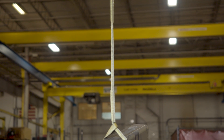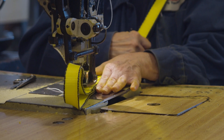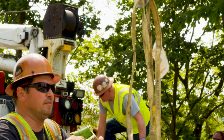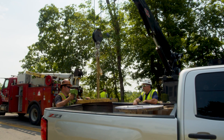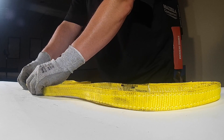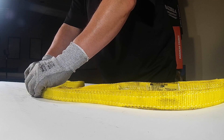Web slings will range all the way from 1 inch up to about 24, could be up to 30 inches wide, depending on the configuration of the sling. Web slings can be made out of either polyester, which is the norm, or nylon — usually yellow in color, but they can be sewn with different colors. They're also lightweight and can be used in a vertical choker basket. With the different widths and plies that web slings are sewn to, you can get a variable in capacities. You can add different types of protection to them, and you also have the option of having them sewn in an eye-to-eye configuration or an endless configuration. You can get a lot of different configurations and add protection to it and still be cost-effective, but you've still got to make sure you've got a competent person inspecting your slings before each lift.